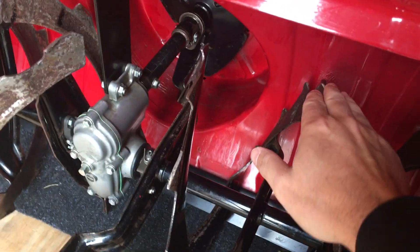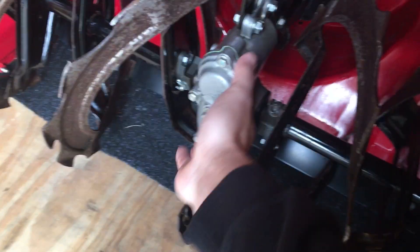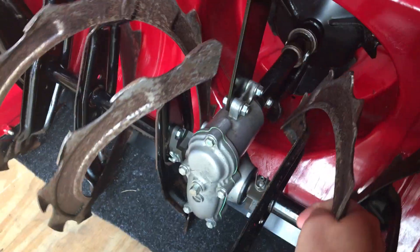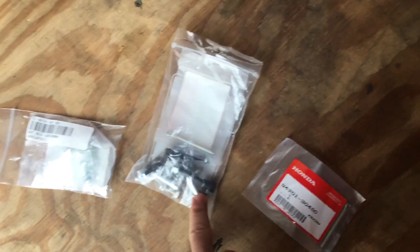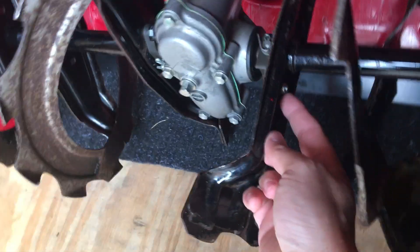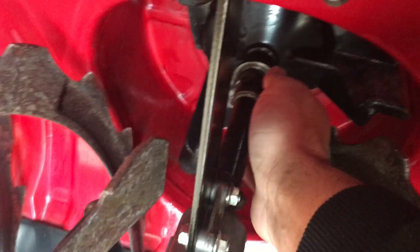The shear pins you've got to look for too, and the teeth. When you look at used, make sure they have teeth and aren't too rounded, because concrete can cause that roundness. Check the auger too — make sure there's no cracks. Make sure it doesn't spin freely because that means the shear pin broke. I keep spare shear pins on the side. There are four different kinds that go inside — one here, one here up and down, one on the shaft, and one in back. The whole assembly comes out, which is awesome.